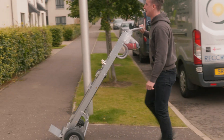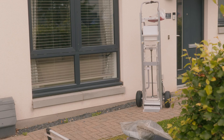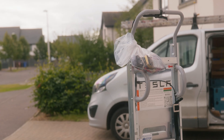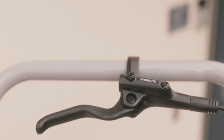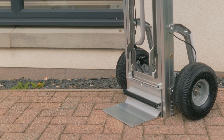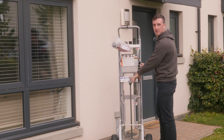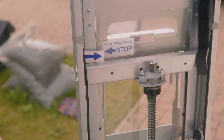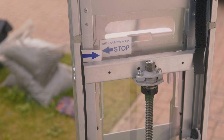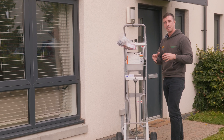As part of Tesla's launch for Powerwall 3, they've introduced this dolly for getting it on the wall. It's a pretty cool invention — it's got Shimano brakes on it which allow you to control and stop it easily. At the back you attach a combi drill onto a spigot here, so when you spin the drill the Powerwall goes onto the front of the dolly and it lifts up onto the bracket.